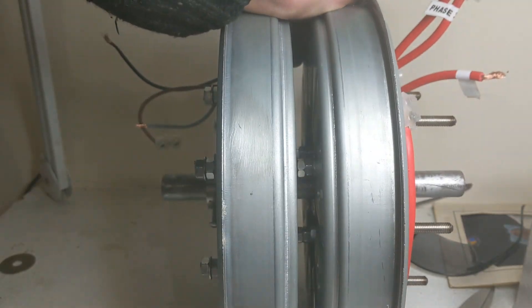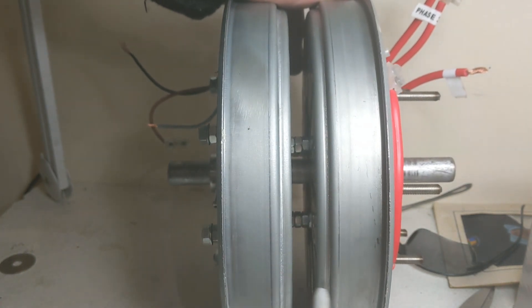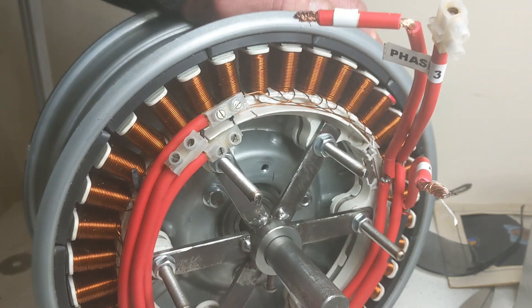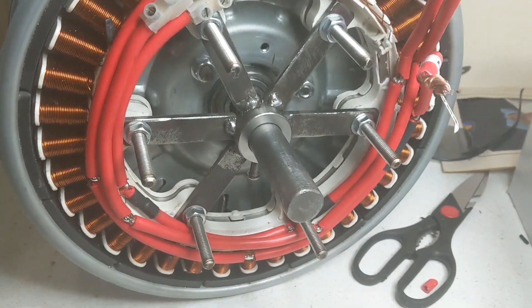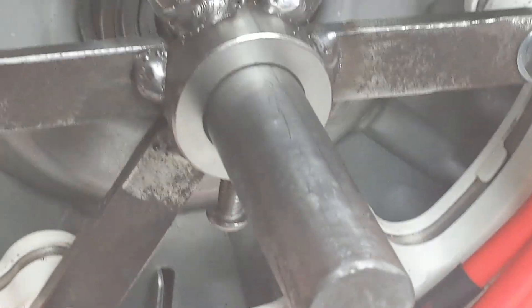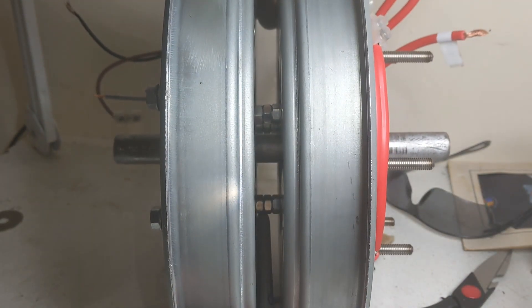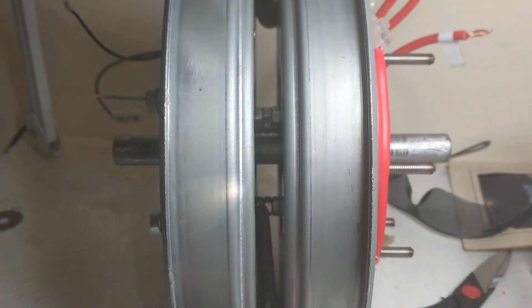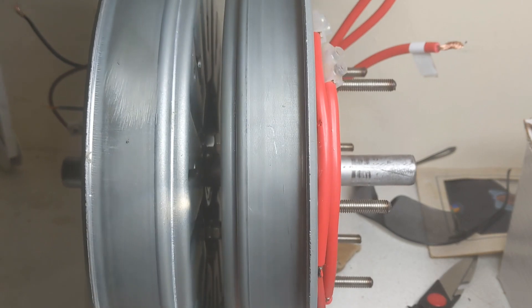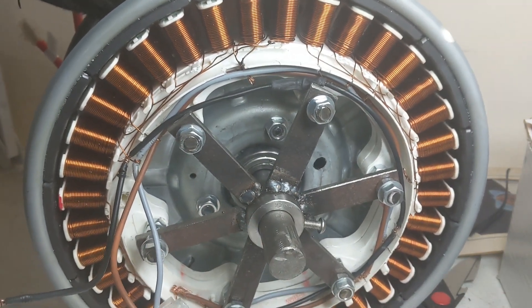The next job is to order a gear wheel — I haven't had any money so I haven't ordered it yet. There's going to be a gear wheel going in here and that will be quite a tricky job because it will need the bore enlarging to 22mm, which is what this is. It will also need to have the holes drilled correctly so it's not getting in the way of the chain — the chain will come round the outside of those bolts. Anyway, that's one for the future.